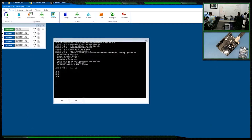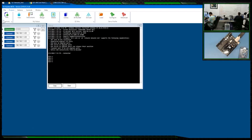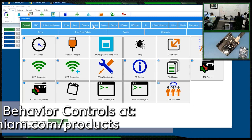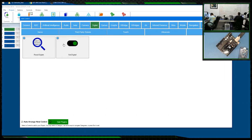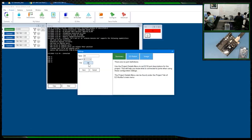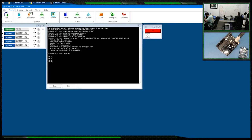The firmware also supports native USB, new servos, and UART. Let's close the debug interface and start using the Arduino. Click Add, go to digital control, and select 'Set Digital.' On this control we'll configure it for D13, which is the onboard LED port. If I push this button we should see the LED turn on and off — it's built right on the board.